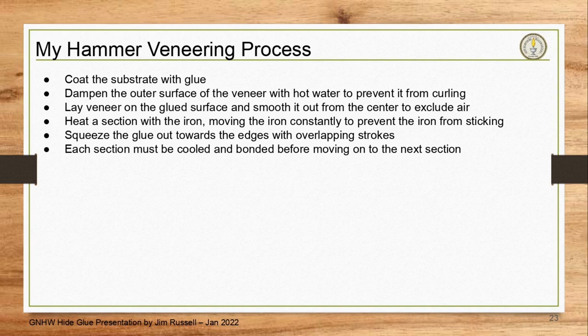and you put glue on both sides, if you did not get that top veneer down completely, and it did not gel completely, or it gelled too soon, and you've got kind of a thick layer of glue under part of it, and you put glue on the top of it, there isn't much you're going to be able to do about that unless you scrape the top and then reheat it to reactivate the glue and then work on it. If you didn't put glue on the top and you're using water, you can use an iron throughout the process and make sure everything is down the way you want it to be. And that's the method I'm going to demonstrate today. But we can also try the one with the glue.